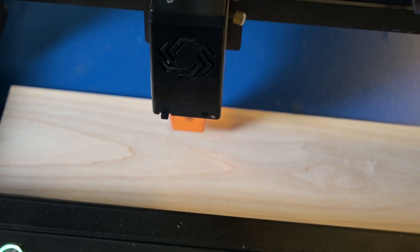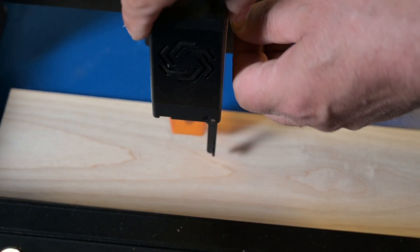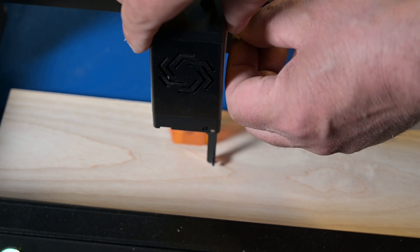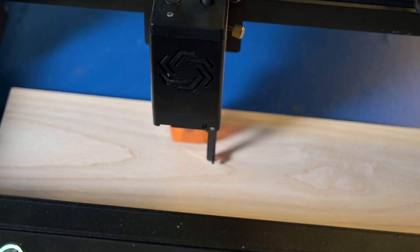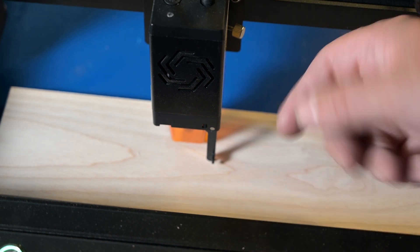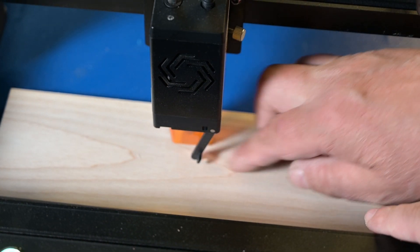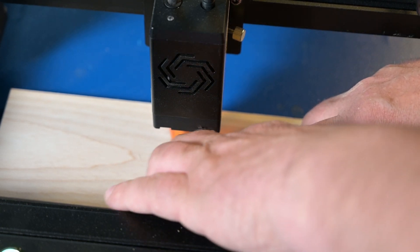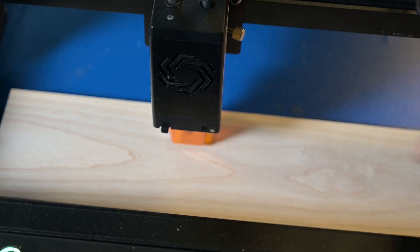It's really simple when you're going to focus — you have this focus arm. Just pull it down and drop it so it hits the material, then you know the laser is in focus. The only downside with this system is when I'm going to fold this up it's easy to move the material, so you need to hold it tight.